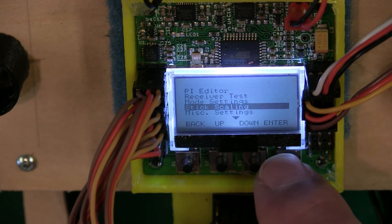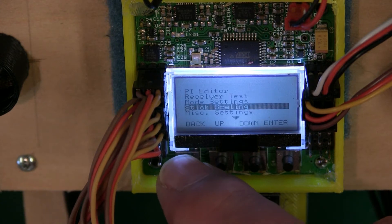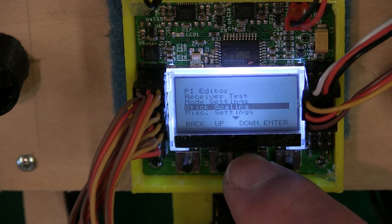Going to Stick Scaling — hit Enter. I leave this on factory setting and set dual rates in my radio instead. I set dual rates to 80, and that's how I fly everything you've seen me fly. Some people might argue with that, but it works for me. If you want to change this or do something different, there are plenty of videos out there.